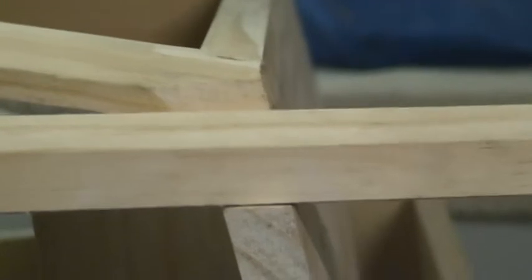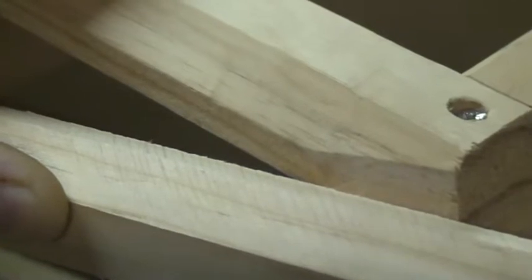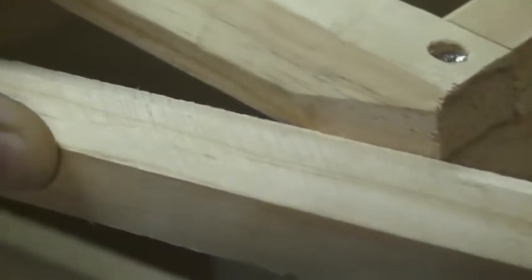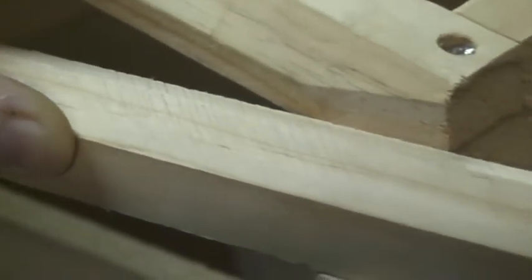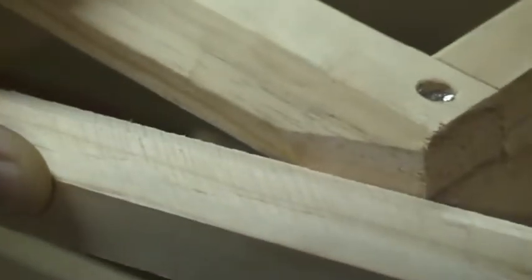Here's the final position of Chine 2. I've taken that down and it's nicely sitting right into the slot that we want it. This edge here is intersecting the rear side of the bow, which is where our station line is, so it's all sitting in the right place. These two flats that we've got on the side of the chines are where the bilge panel is going to sit. You just need to make sure that those both line up — the easiest way is to put a flat bit of wood across it, make sure it's flat, and just use the plane to flatten them up.